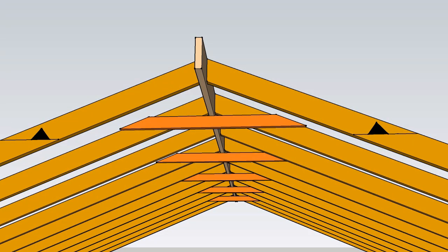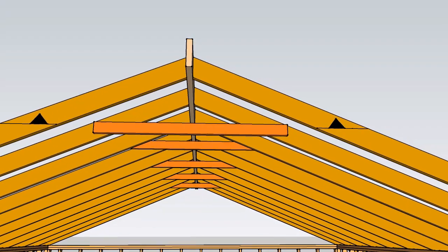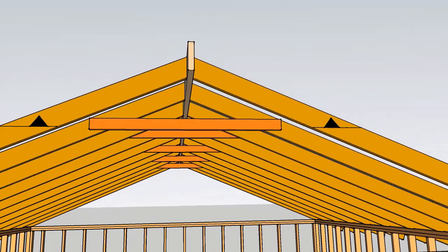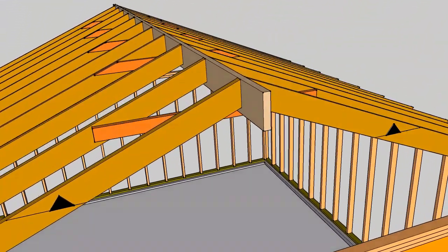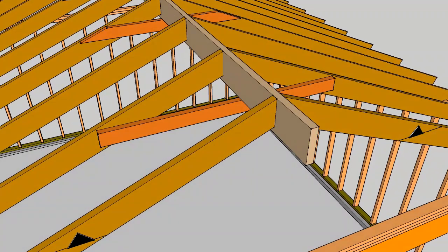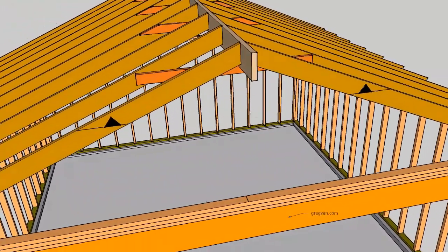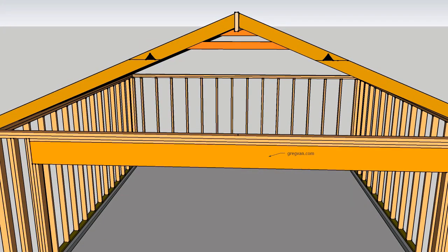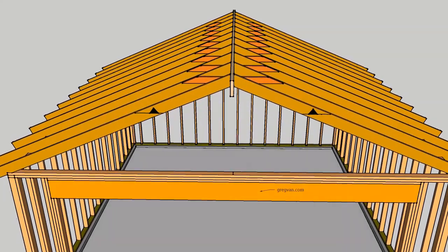Here's an example of what it would look like underneath. You are allowed to place them in the upper one-third section — they do not need to be placed right underneath the ridge, though that's usually how I have them. When I do construction I put them up against the ridge board to give it some extra support, but they can be placed anywhere within the upper one-third of the distance.